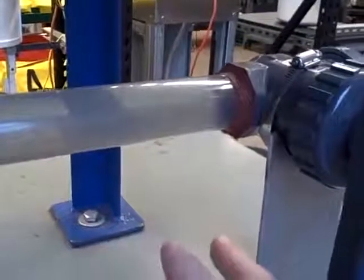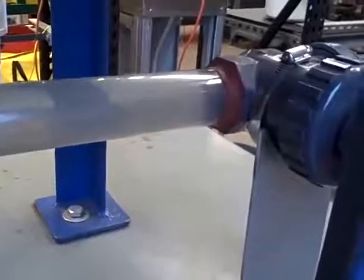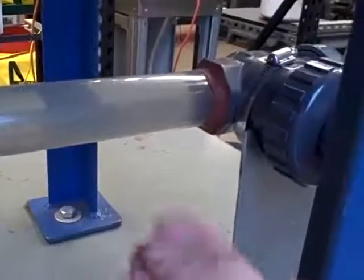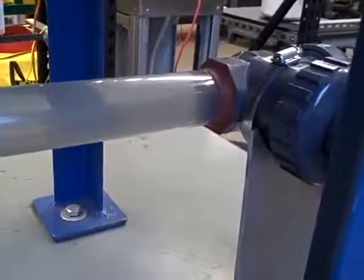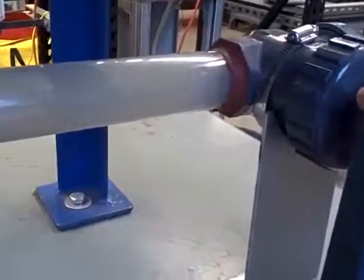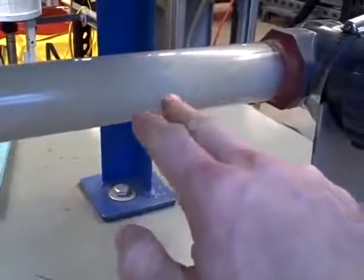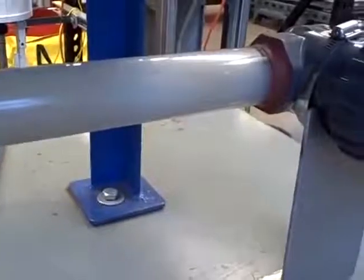There's no debris, there's no solid material through here. That solid sounding sound is really the collapsing of the vapor bubbles as they go back into liquid form. You can really hear it now. You can see it occur inside of here. It's a very pronounced action and noise.